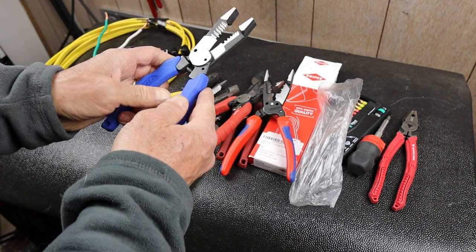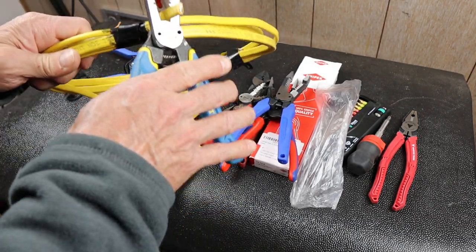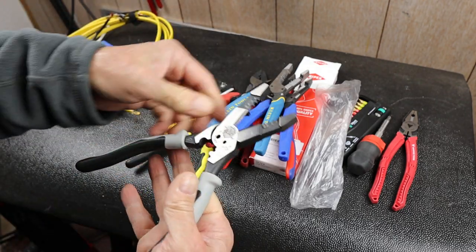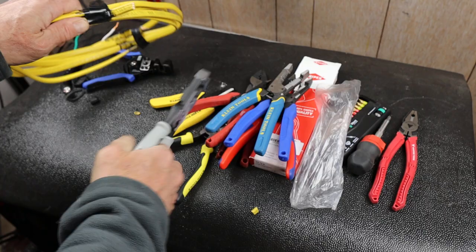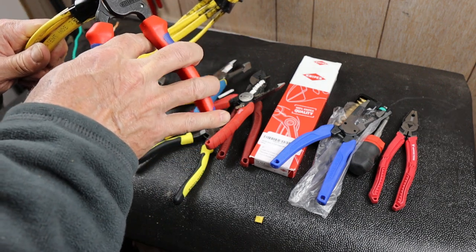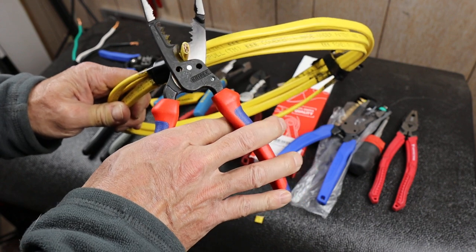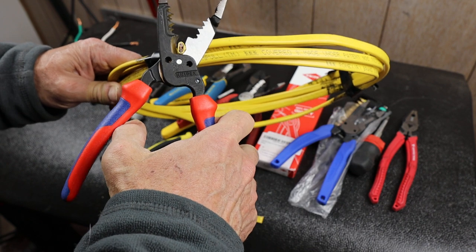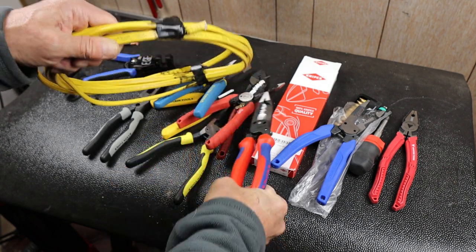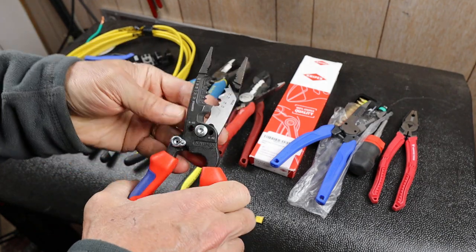It's got this great big set of knives. One of the problems I've noticed with some of these is the knives aren't very big. In fact, this one is really small, which disappointed me — you can see how small that knife is. So if I grab like this Romex here and throw it in there, it's just barely the size; any bigger and the larger knives here work much easier. Let's try these. Got to expand them — wow, look at that grab. Look how much it's still within the knife and it actually seats it to hold it. Let's grab it and cut. Oh, that is so easy! Unbelievable. Let me see how many fingers — two fingers, two fingers and a thumb. Can I do it? Whoa, I did it! Two fingers and a thumb, and I cut through — I think this is 12 gauge Romex. The knives are just beautiful.